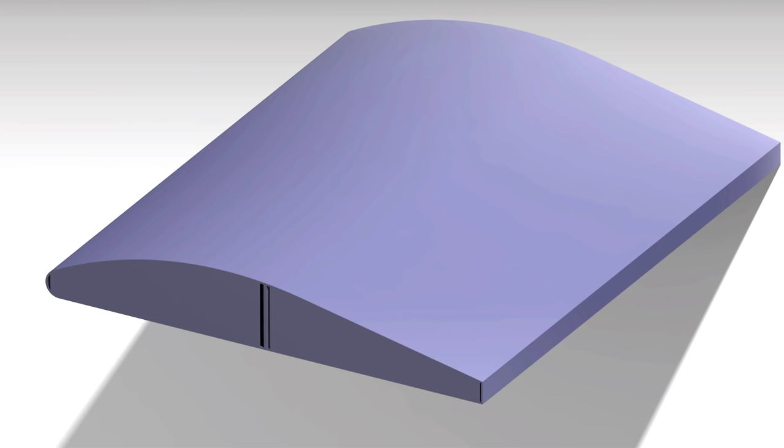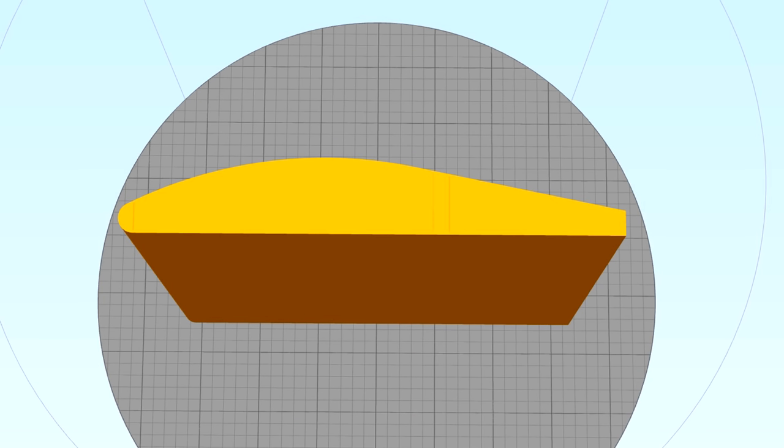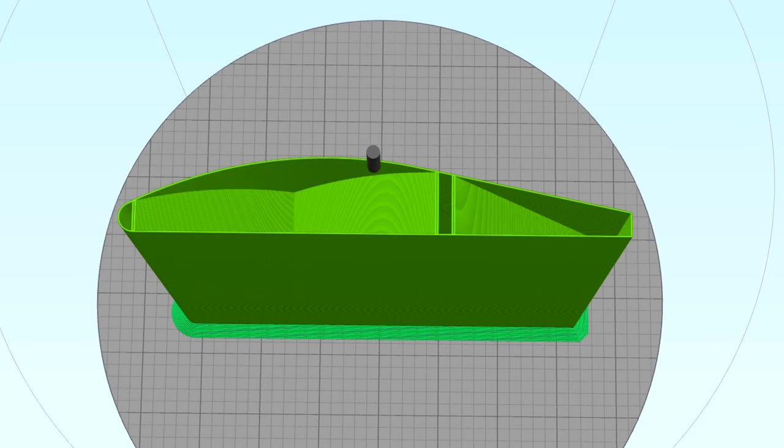With this CAD model, the majority of the wing is solid, but the ribs on the internals of the wing are actually cut out of the solid model. If I put this into the 3D printer slicer and set the infill percentage to zero percent, it makes the solid object hollow. The outer skin on the wing should now be one layer and the ribs are actually the outer layers of the solid rib objects. If you have a 3D printer and want to try this, design a solid model of a wing, add cutouts where you'd like the ribs, and see if you can work out what I'm talking about.